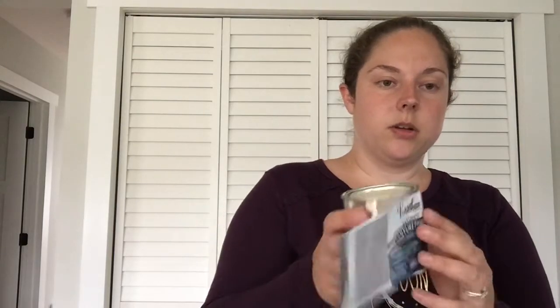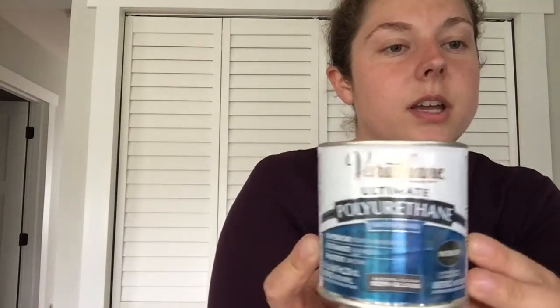And then to protect the stain, I just got a small can of it. My nephew tore off the paper on it, but it's just a clear coat — it's water-based. It's only a semi gloss because I really don't want it to be super glossy with the furniture. I feel like my square coffee table needs a little bit more of this because it seemed pretty dry and it really soaked up the clear coat. Sometimes you just have to keep adding layers to your furniture if it's really dry. It helps protect the stain and gives a nice finish, and it seals the stain in too.